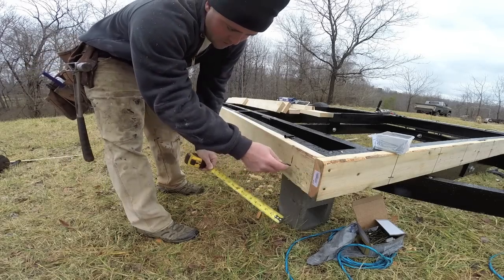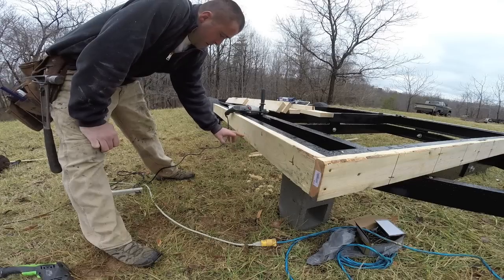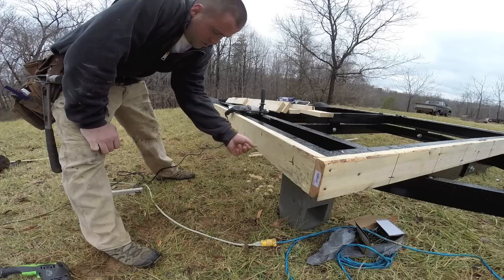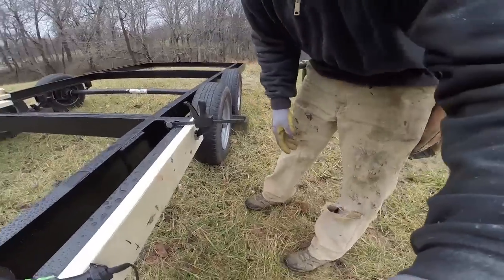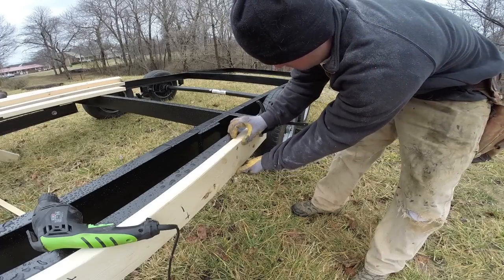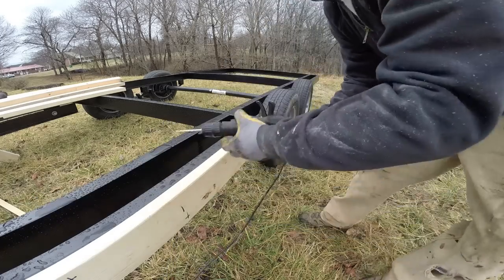I'll just do my layout again. The first one is going to go in the center — one for six high, two for six low. The reason I'm staggering them up and down is if you were to just go in the center and a split happened in this piece of wood, those screws would be useless and those boards would end up falling out. Before I get too far ahead with drilling all those holes, I want to make sure I have an equal distance on the board. Since I ripped these at a five and an eighth, they're a little bit thicker than the steel, so I'm just going to take my finger and feel to make sure it's the same distance.